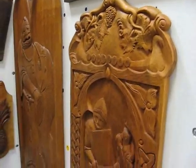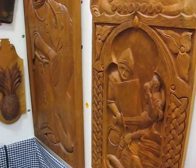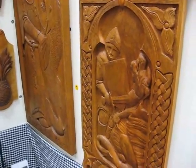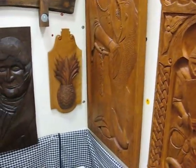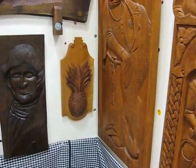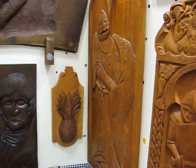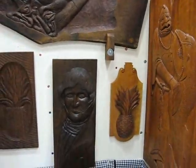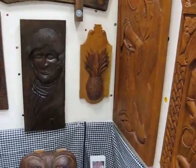In the process of relief carving, it's very important to have a visual concept of where you want to go in the wood. You draw your subject matter into the wood, and you first want to rough out the general form without being concerned about detail until the very end. It's basically a three-step process: the roughing out, the modeling, and then the detailing of the subject matter.